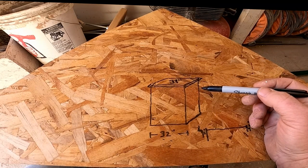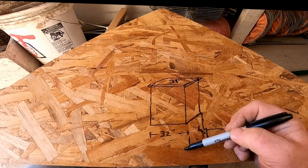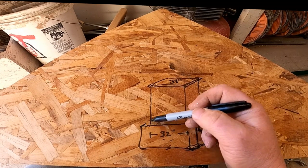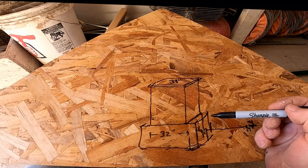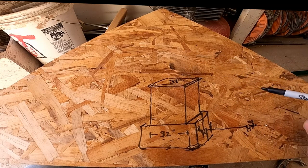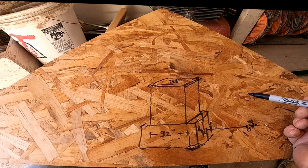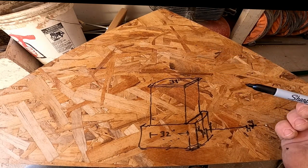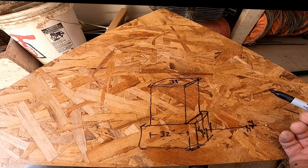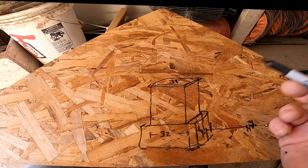The reason we're building this before the column is because we have to dig down 32 inches to frost depth for a footing underneath the column. So we're going to have a footing under the ground that's 32 inches deep — that's our frost depth. What we're going to do is pour this concrete and these caps at the same time. The molds will be sitting out on the ground and we'll pour them while we're doing the footing. Then we'll frame it up, stone it, and by then these caps will be hard enough to set on top, so you're not wasting time doing caps later.